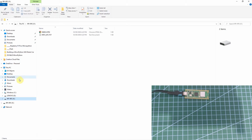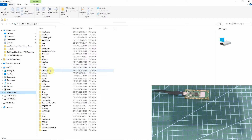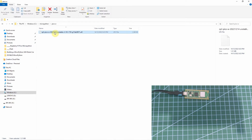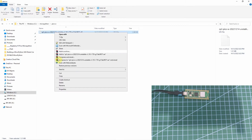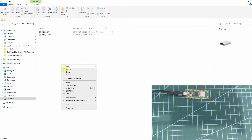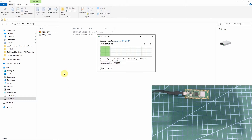What I'm going to do is just copy the Raspberry Pi Pico W firmware into that RPi-RP2 mass storage. Let's do that. I'm going to copy it here, then let's wait for the copy to finish.